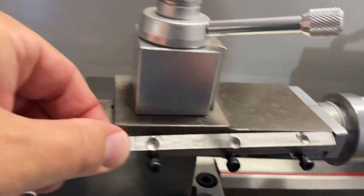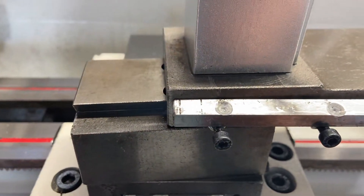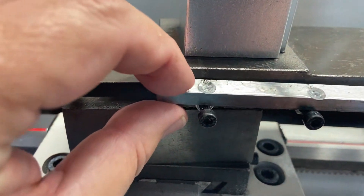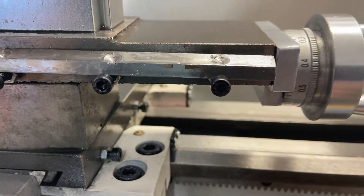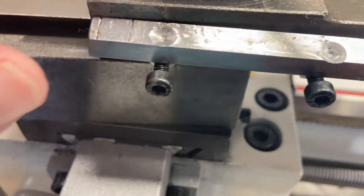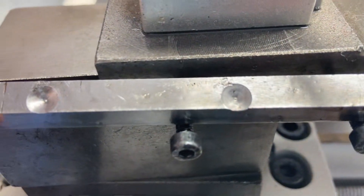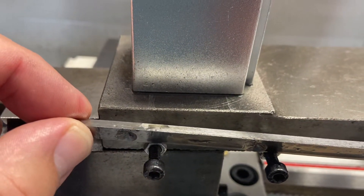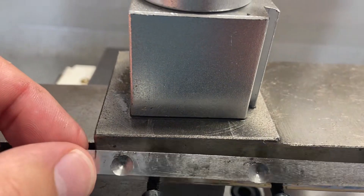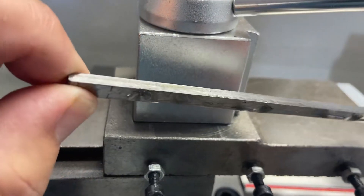Number one, these don't line up. The dimples that they put into that jib — you line one of them up, they don't line up with the actual screws. And as you can see, I'm chewing up the top edge just trying to get that thing to seat properly. See the marks on the top edge. They really need to seat down in the dimples. Furthermore, I believe these dimples are too low, causing it to push when you screw these in and they do catch the dimples.